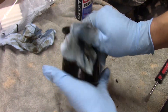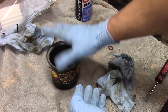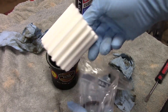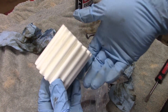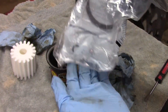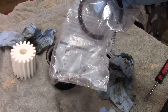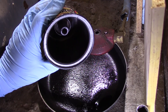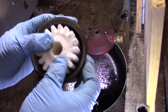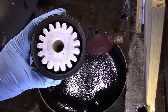It's important for your pump pressure to be maintained so that your burner functions properly. There are a couple of different kinds of filters for this same filter housing — this is the one I use; I think it has more surface area. The other one is a gray fibrous filter. This one also includes the bolt gasket, the main gasket, and the bleeder screw gasket. You can see there's a raised piece in the center — you'll want to line that up with the hole and push down.